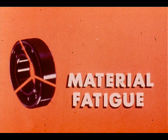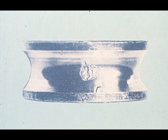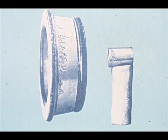The final category of bearing failure that we will show you is material fatigue. This is often the result of the other causes we have already outlined. Here is the inner race of a ball bearing with an advanced form of fatigue called spalling — a chunk of the inner race has broken away. An even more advanced state of spalling is shown in the next picture, where stresses on the edge of the bearing caused overload and material fatigue, completely ruining the bearing.